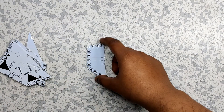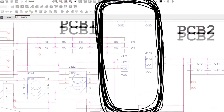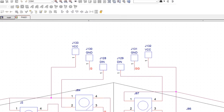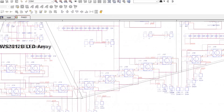To accomplish this, I prepared the schematic so each section has components and the breakout point is a cut line. At the edge of the first PCB there are three connectors for VCC, D-out, and ground. On the starting edge of the second PCB, three connectors are there as well for VCC, D-in, and ground. VCC of the first PCB gets soldered with VCC of the second, ground with ground, and D-out from the first PCB gets soldered to D-in of the second PCB. I used this method to connect multiple PCBs together along with their electrical components.